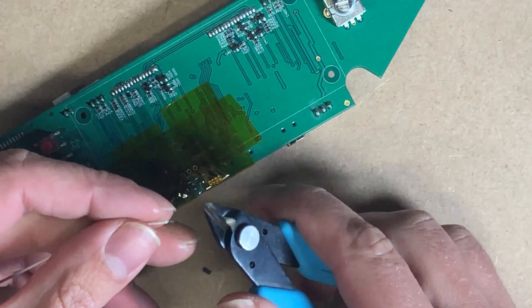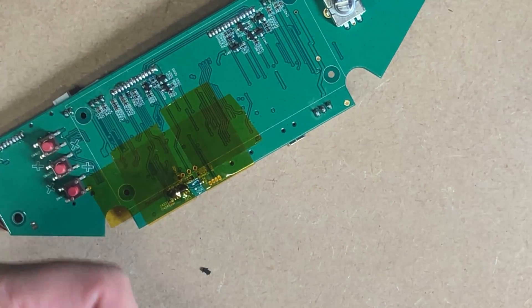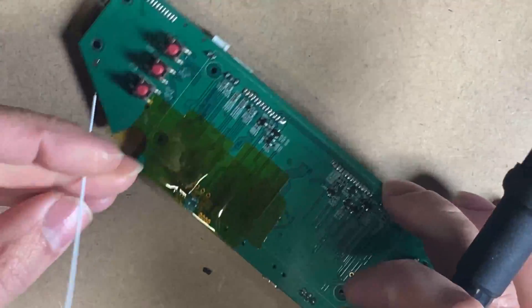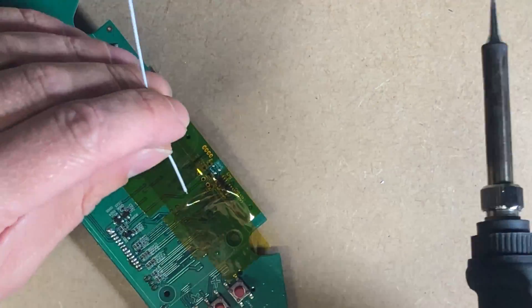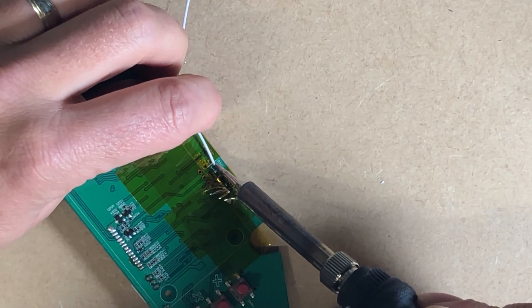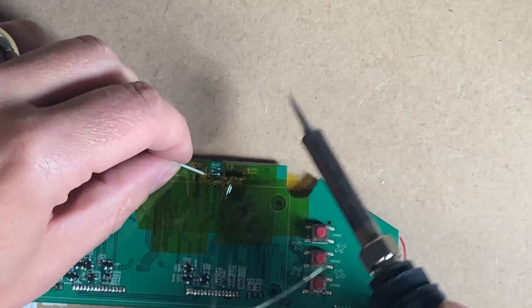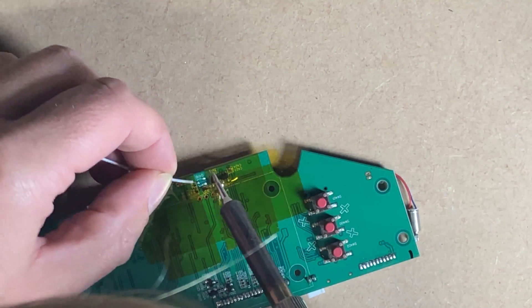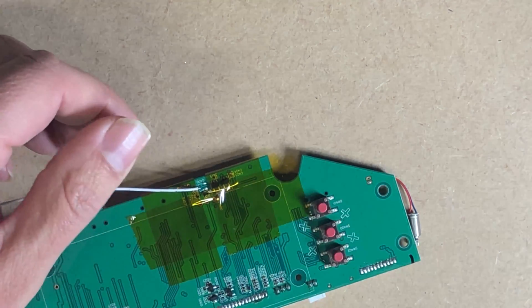Now I'm just going to cut down the core on that wire — it's a bit long for that pad, so I'll just snip that off. Make sure it's out of the way of that board; we don't want any strands of wire around any components. Get the wire pre-tinned, touching the pad, and just apply a bit of heat. Then I'm going to loop it up around the board to the front and put a bit of an angle on it. Give it a little wiggle to make sure it's on there.